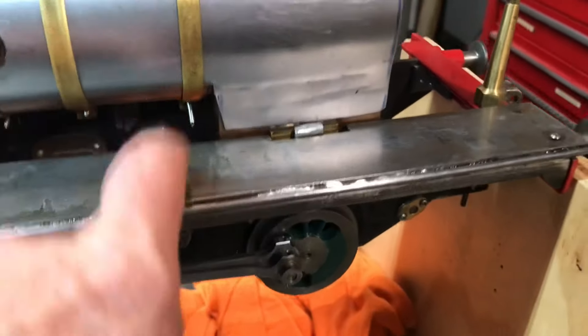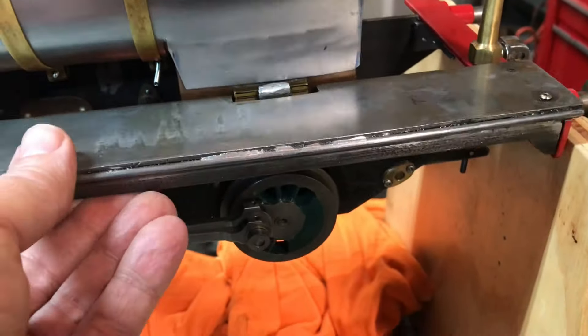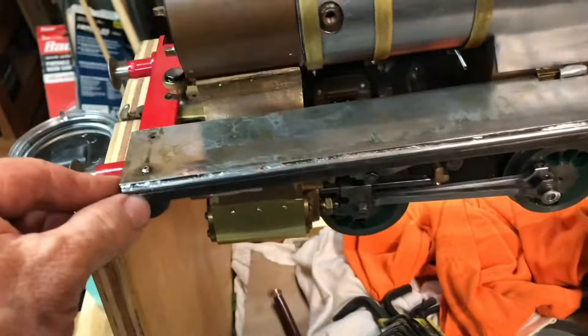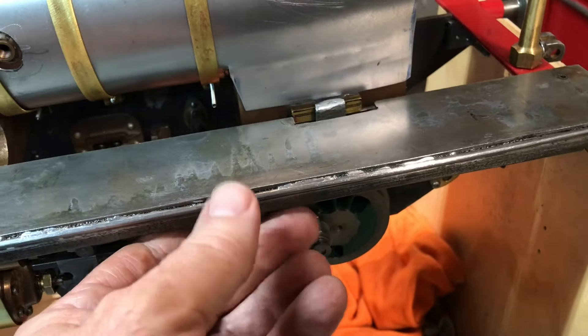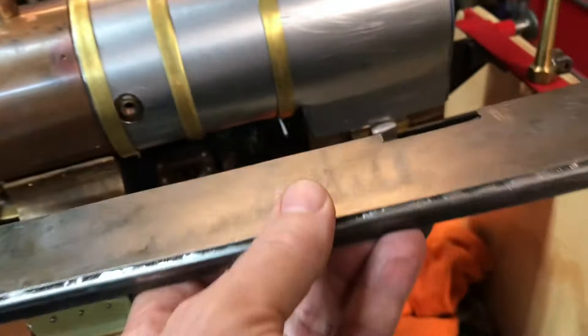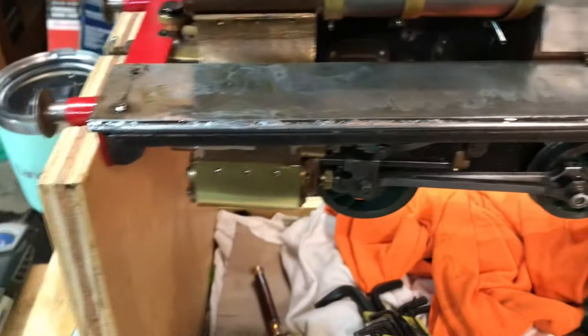Here is the soldered semi-finished foot plate — extra thick, extra heavy duty with the little steel rod soldered onto it. It's a terrible soldering job, really, but it's stuck and everything seems quite solid, so in general I'm pleased with it. I've let it soak in the pickle a little bit to break down the flux. Now I'm going to wash it with hot soapy water and let it sit overnight. I think I'll use JB Weld to fill in the rest of the gap, smooth out the seams, and then prime and paint it. I'm pleased with the thickness and the heft and the additional weight that will help put on the chassis.